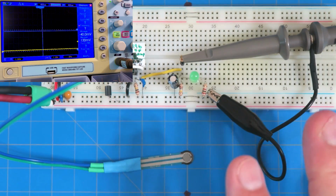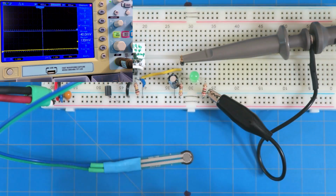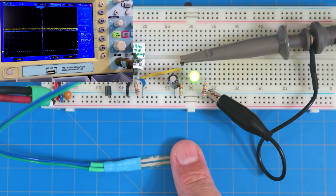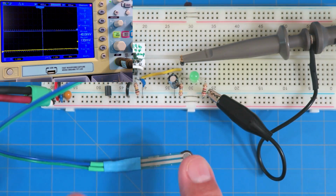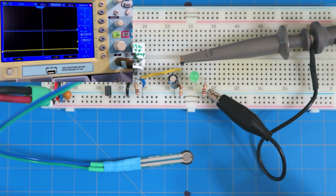It's based on op amps, or you can make a comparator out of an op amp. And at 3 volts, it would snap on and turn its output on. So we would basically have a threshold, and at 3 volts, which is some certain force, it would turn something on. Maybe it would say, hey, the load is too much for the elevator, or whatever.